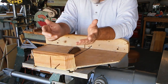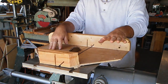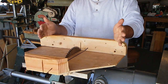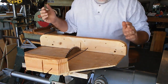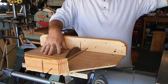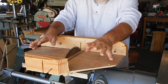Okay. Here I am at my Shopsmith set up as a table saw. You see I'm going to use my crosscut sled. If you wanted, you could use a couple crosscut gauges or miter gauges with a piece of wood bolted onto them, so long as you get a nice even push and no lateral movement, because of course you're trying to cut a nice square 45-degree angle. This technique you can do on a traditional table saw. I could pull out my 8¼ inch Black & Decker mid-80s little table saw and do this exact same thing using a crosscut sled. Doesn't matter.